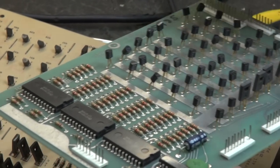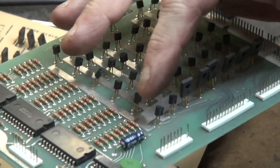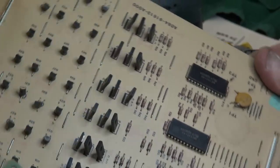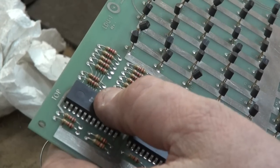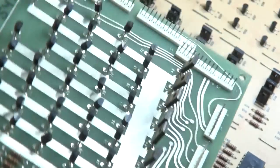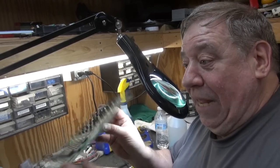These are all the different lamp transistors — we have three, four, five, six, seven. And that would have been eight. Counting across: one, two, three, four, five, six — so we have a total of 48 computer-controlled light bulbs. Where the Bally one had 64, so the Bally one had four. Each one of these would drive about 16 of them. There's only three here, so we're driving one less group. A much smaller board, but you don't need more than 48 computer-controlled bulbs in any pinball machine.